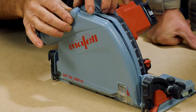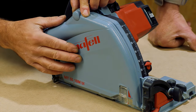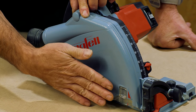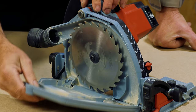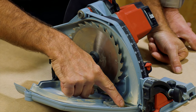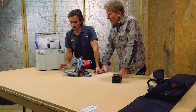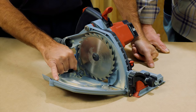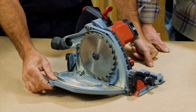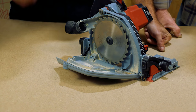If you look at the side of this, where you'd normally undo your blade on other track saws, this is completely enclosed, so it's quite safe — you can hold your hand there. The air is being extracted a lot more efficiently from this particular saw, right down to the fact that you've got a beautiful little gasket there, similar to what you'd have in an engine, keeping all of that air sucking the dust out into your extractor or into the bag.